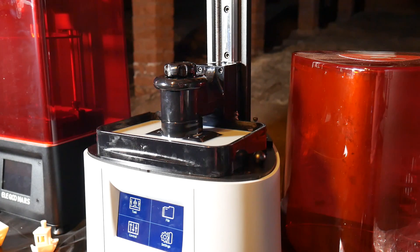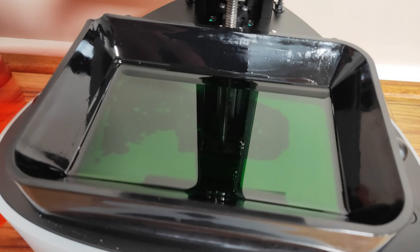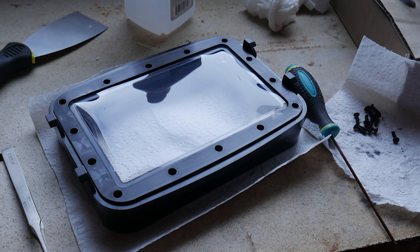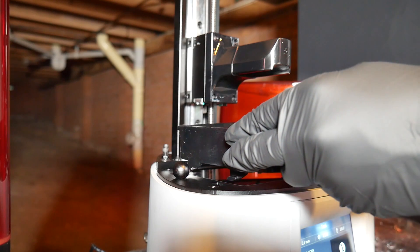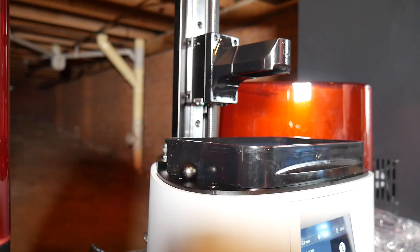This is where I noticed a small leak in the bottom of the vat — the FEP tray — and it's evident in the photos. It was a very tiny leak, easy to clean up, so I needed to change the FEP film. Helpfully, the replacement for the Nova 3D Elfin is an injection molded cover that holds the FEP taut, which you screw into place — you don't need to fiddle with a loose piece of film like on regular metal vats. This does mean you'll need to get your film from them, as it's specially designed to slot in with two knobs on the machine, but it does make changing the film very easy.